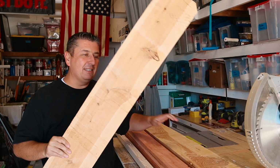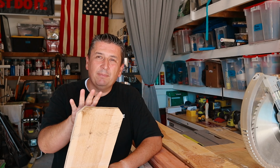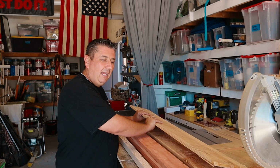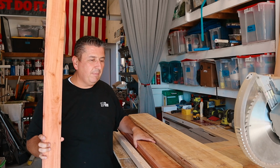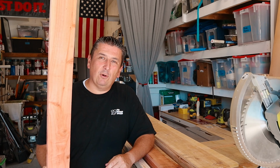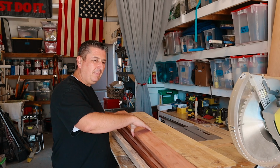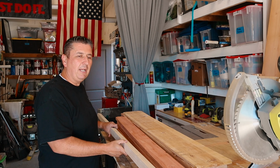But what I'm going to do is use this lumber right here. This lumber on the table basically represents 1 planter box. I've got 6 5-foot cedar fence pickets, and then I've got 5 6-foot redwood 1x4 fence pickets, and then I've got a 2x2. I like the 2x2. You can use a 2x3 or 2x4, but I use these.